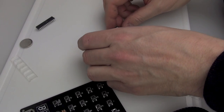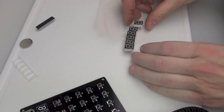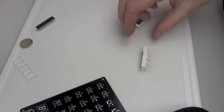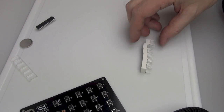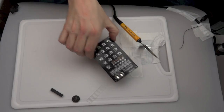Just examining my work, soldering any joints I wasn't entirely happy with once I got it under the light, and then clipping off the little tiny legs off the back again — even though they're tiny little legs, we're clipping them back because we want the circuit board to be as flat as possible. Now we're moving on to the display segments. We're going to have them the right way up with the decimal point at the bottom, and also examining each one to see there are no sticky-out bits of plastic on the edge because we want them all to go flush to one another.